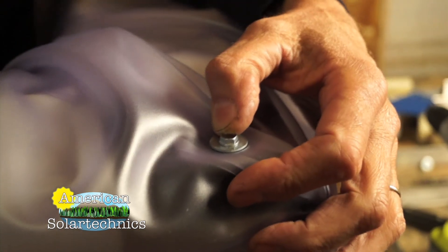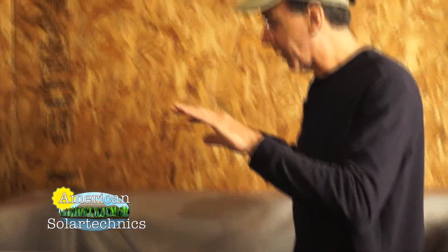Today we're going to put the cover on the tank. I decided not to fill the tank with water because it's easier for the show and tell. What we've done is screwed the liner at the outside edge with some self-drilling screws — right out at the outer edge — because we want this away from where everything is sealed.